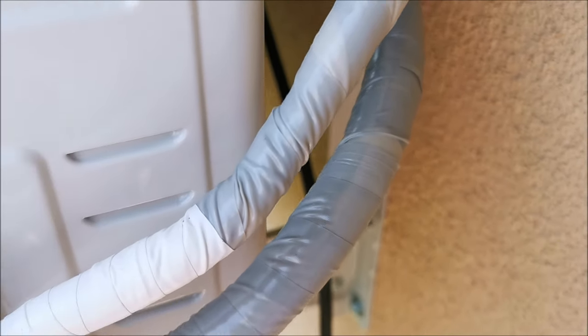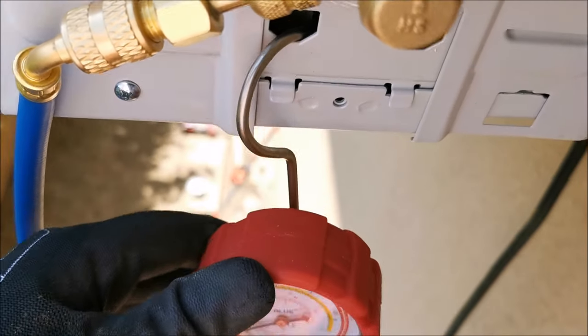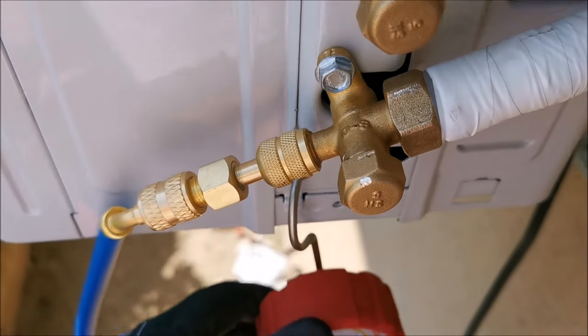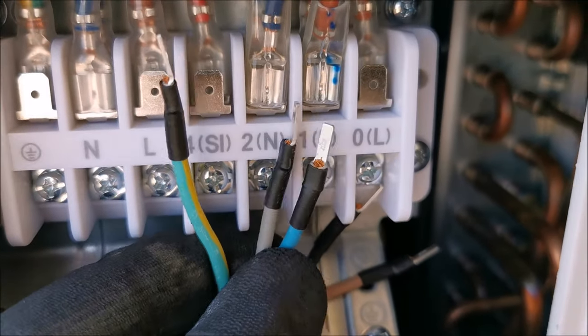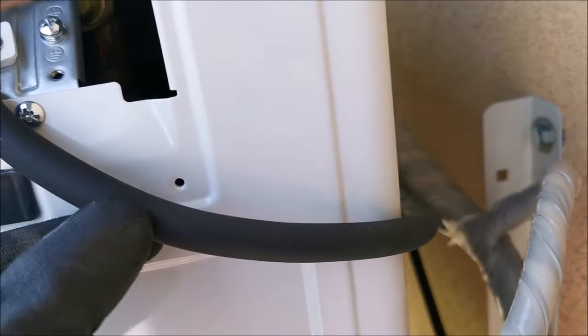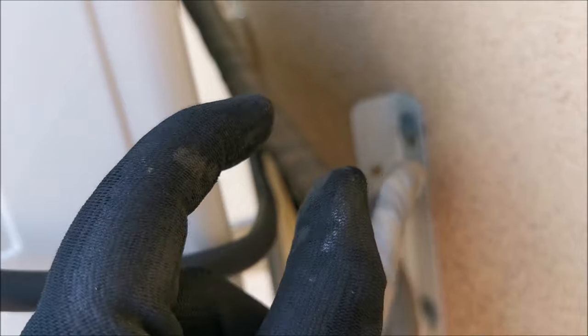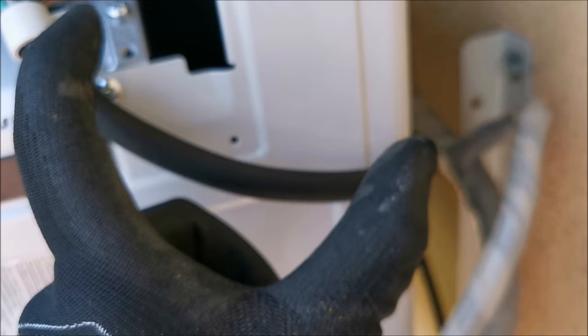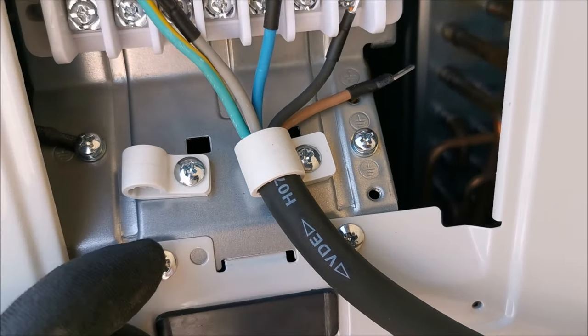Make sure you wrap the insulation like this so the foam doesn't rot quickly. Now we're doing a pressure test at 8 bars — we'll leave it pressurized. That pressure was created using an old refrigerator compressor my father kept from his AC installation days. Now I'm connecting the wires. This wire is at its limit inside the terminal, so make sure you don't leave more wire than necessary inside. Hisense — if you're watching — make the wire about 10-20 centimeters longer; that would be better.